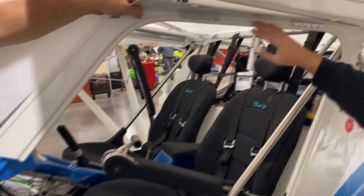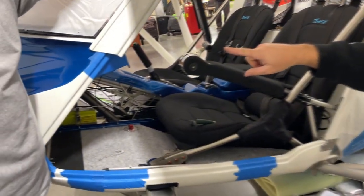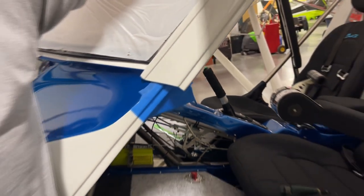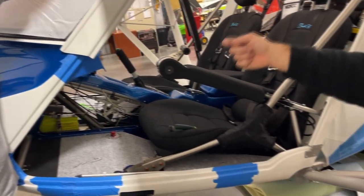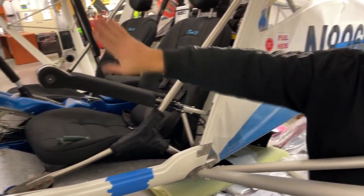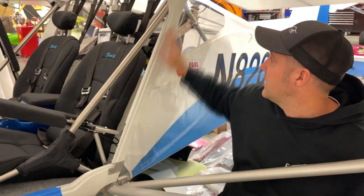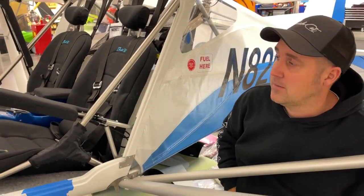We come forward. Now we're gonna put the door back on. We're gonna set our lines there. I'm gonna go inside and mark the inside so we can notch that out to make that sit flush. Once that sits flush, we'll double check everything and then I can do my riveting down the side.